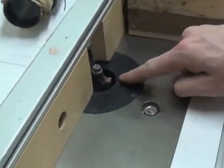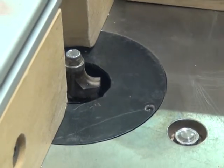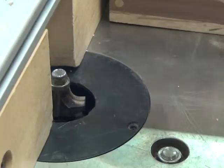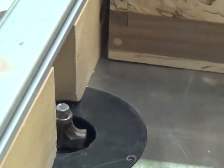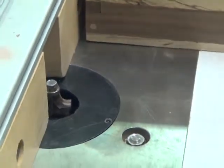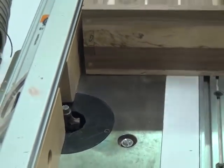Okay, so actually the shape of this router bit is a little different than the one used in the past, and it'll make a different kind of shape in the piece of wood. We're going to use this to round over — kind of make a half round or a fillet on each of the corners around the bottom side of the box only. We're not going to do the side corners so that the lid will still look right when it's set on top.